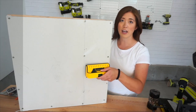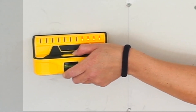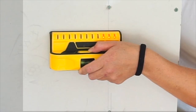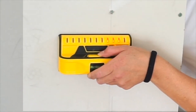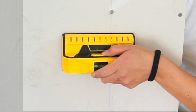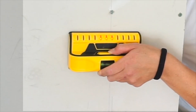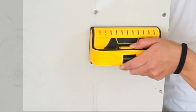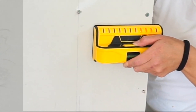It just has a button right here, and you can see I'm going to start right here where there's no stud. As I go and slide this closer to the stud, you see these three red lines that show up — sometimes four. That is showing you exactly where a stud is, and as you keep moving it, the lines continue to move. That way you know that the stud is right there. And then as I move in this direction, you can see that the lights start to blink again because we know that there is a stud here at the end.